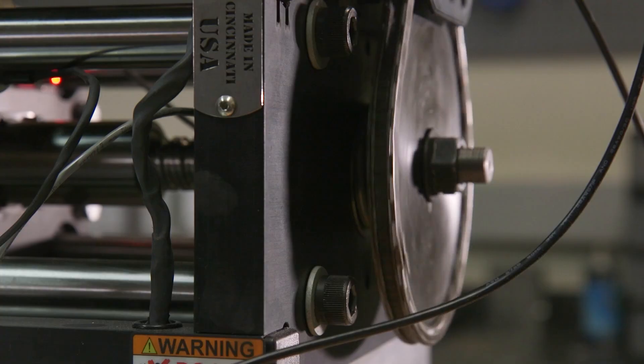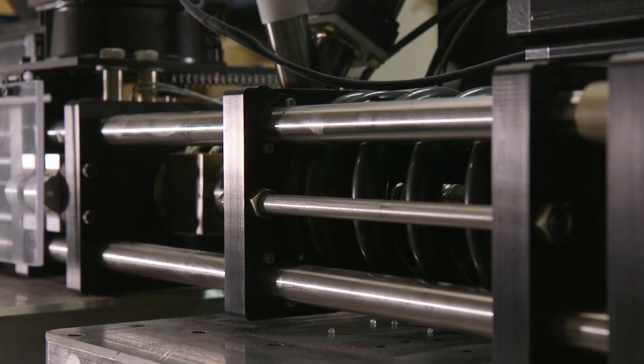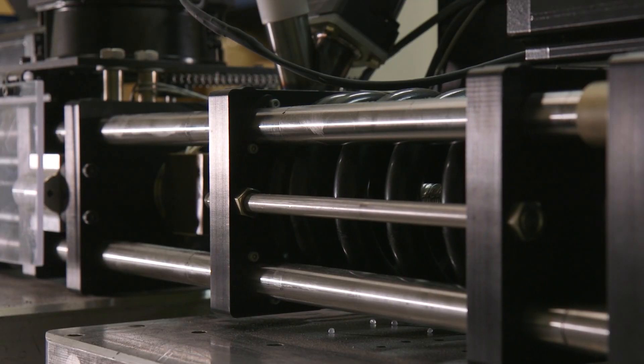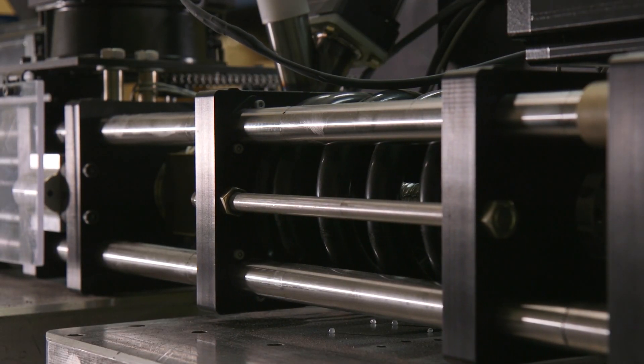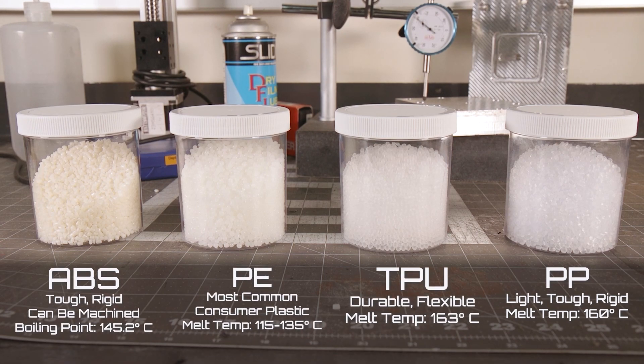The style of the press also makes a big difference. This is a plunger drive system versus our traditional presses out there that are a screw drive. The plunger drive does not allow you to put any additives in or color it, and it really restricts you down to fairly general purpose resins such as polypropylene, polyethylene, TPU, ABS, and maybe in some cases Delrin.